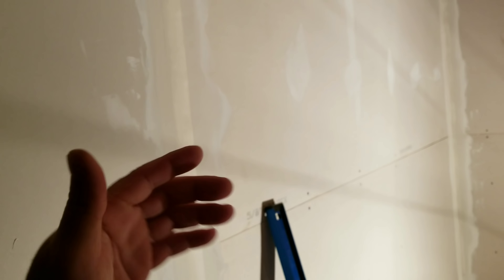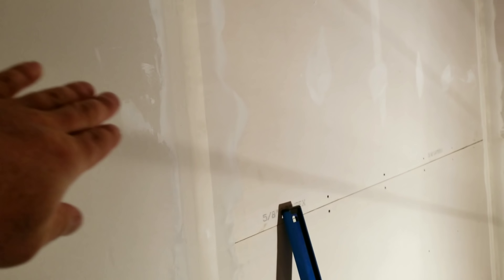The wider the area that you make — you don't want it too big, but you definitely want to feather out quite a bit — at least no more than 12 inches. That way, when you look down the wall after it's all painted, your eye is not going to be able to focus on one spot because it's feathered over. If you only stick with a small spot and you paint, you're going to be able to see the shadow, you're going to see that bump. There is always a bump because we have two pieces of drywall together, and when you fill that gap with mud and put the tape on top, that tape creates a small bump. So you want to feather that out so when it's all said and done, you don't see those bumps.